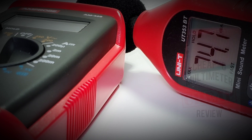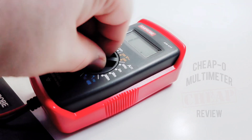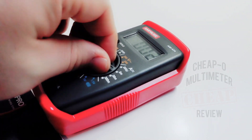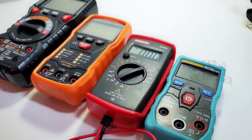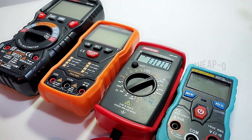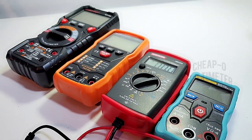Let's check out AC voltage — should be looking at 120 volts and we get 121. Pretty close, good job. Something else that's really nice is the selector switch — it has a really nice clicky feel and lands on each range with authority. In terms of overall size, it's definitely a small meter compared to the Fluke, and fairly close to the Richmeters 403B but on the smaller side.